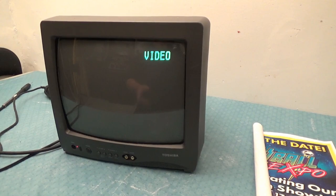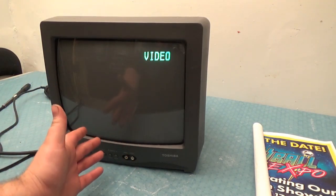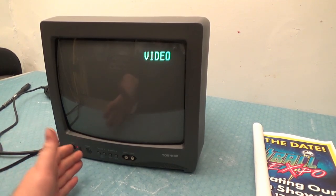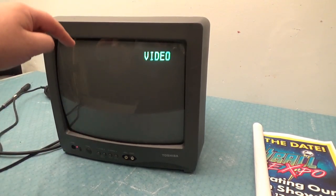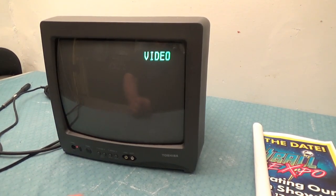You can use this on any standard resolution CGA or arcade machine. So the first thing you want to do is pick out the right TV — it may be kind of hard. Just about any TV can be an arcade monitor. We're going to use the original guts and hack them to work. But I'll tell you some bonuses — some things you might want to look for.